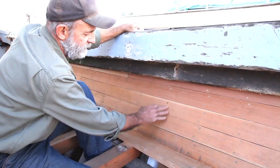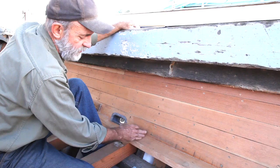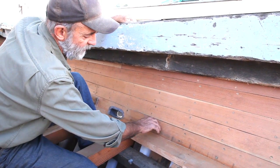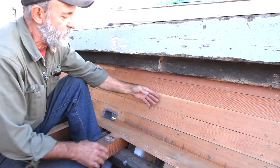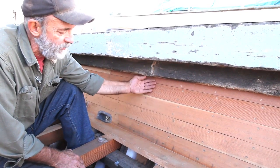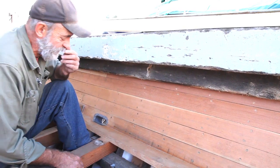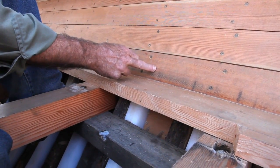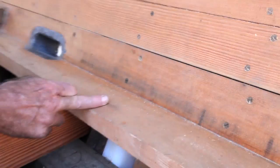We've put a brand new ceiling inside the framing here — the last time you saw the boat it was wide open, but now it's got a brand new ceiling in it. This is done in a traditional fashion, fastened to the framing with screws, because the plastic doesn't hold nails well. So we've screw-fastened the ceiling off to the framing, and it's been beveled on both edges so that it can be caulked with cotton to be nice and tight. This is as opposed to doing it with plywood and fiberglass — I didn't want to go through all that with epoxy and all kinds of different products.